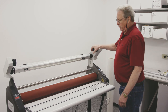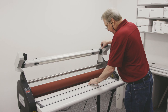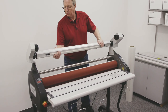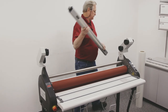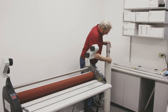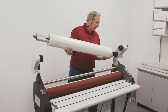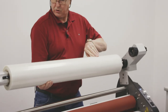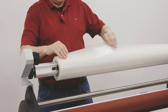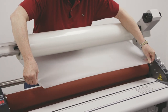You'll notice that I've got my rewind shaft taken off, my safety shield out, my print hold down clamp taken off because we're going to use a board. I'll take my film supply shaft and put that on. Now when I put this on, because this is a poly-in film, I want to make sure that the film is going to unroll from the bottom because that's where my adhesive is exposed to the rollers.